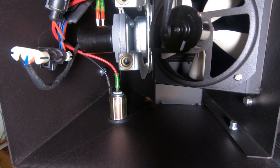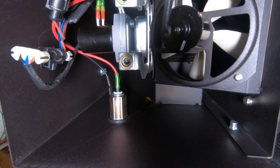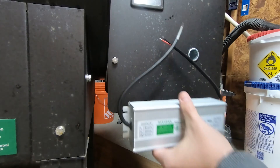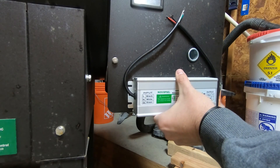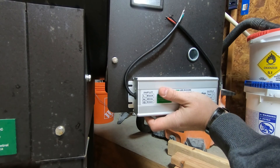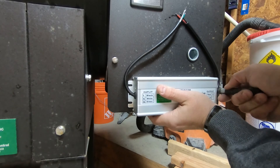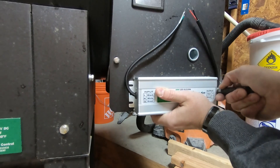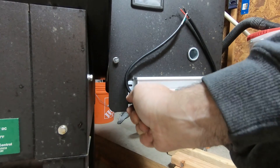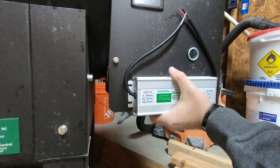Now that we're looking under the hopper, you can see just below the cigarette lighter plug there's space for the inverter, which we're gonna see in this next clip. Here I'm lining it up somewhat flush to the bottom — I offset it about an eighth of an inch high — and then I'm going to mark with a center punch the holes to drill. In this inverter just behind the cable there are two little holes, and that's what I'm gonna use to hold this thing on the inside.